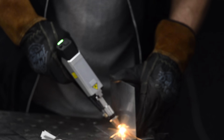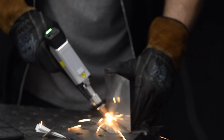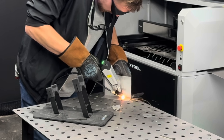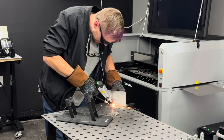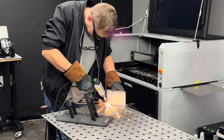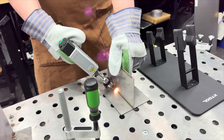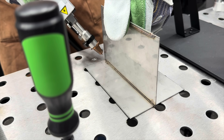It seems so easy it feels like you're cheating. And unlike normal welding, the heat stays so concentrated that there's no need for tack welding to keep the metal from warping — you can start with laying down solid welds without any issues of warpage. The only thing you have to worry about is keeping track of the angle and figuring out how to stop the weld without getting it stuck at the end of the line. A few of us had a problem with getting the technique down for stopping, but Nick from 6-8 Woodworks was becoming a pro and coming out with extremely good welding results.